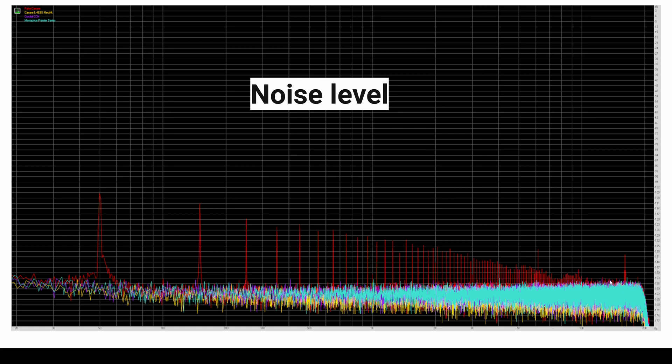If you look closely at the plot, the yellow series of lines — that's the legitimate Canare StarQuad cable — is at the very bottom, showing maybe 2 or 3 dB better noise rejection than the other cables. Are you going to hear that 2 or 3 dB when you're at minus almost 170 dB? No, you will never, ever hear that. So while that might be a selling point for that company, it really doesn't help in our studio, and those cables cost a minimum of $40. Almost everything you connect the microphone cable to will have a noise floor higher than minus 170 dB, so we're not limited by the quality of our microphone cable — only if the cable itself is defective or wired incorrectly.